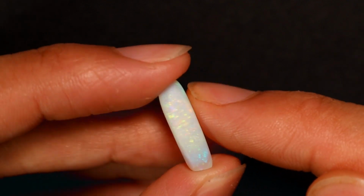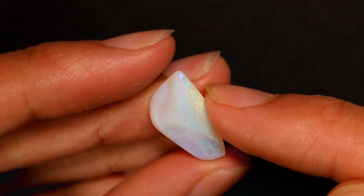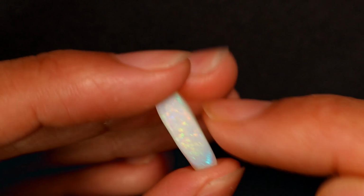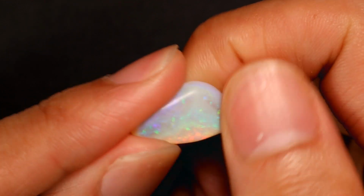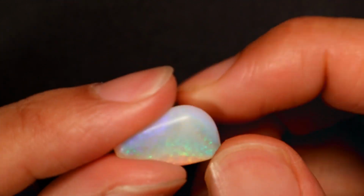So now we're going to move on to the 1200 and the 3000, and we should start seeing a bit of a shine, less of this fog, and then we'll really hit it with the polish and give it a proper shine. Now we've just finished the 1200, and the 1200 is nowhere near as bad in terms of feel as the 600. That's the first thing you notice. It's starting to get much smoother and less grippy.